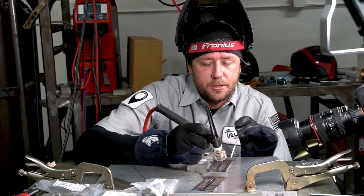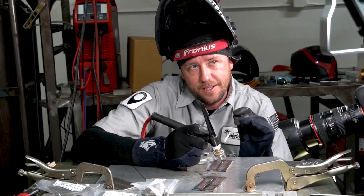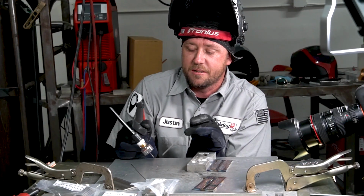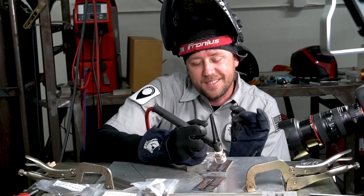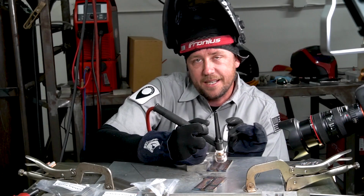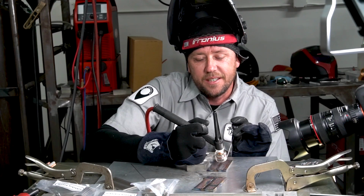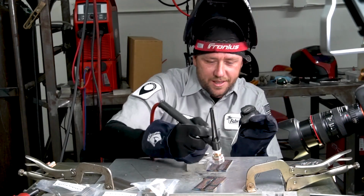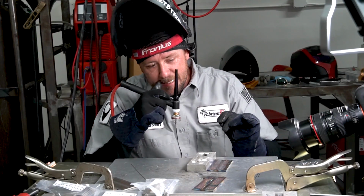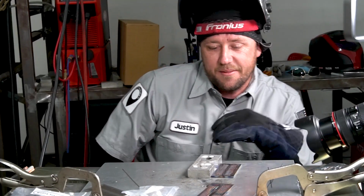Forward meaning the direction that you're traveling, and that's usually kind of tricky because normally you're traveling into your filler wire. On this one, we are technically adding our filler wire to the side of that weld pool because we're traveling back and forth in a zigzag, but technically, even though we're making a zigzag left and right, we're still traveling this way, which this would be forward. So tricky as it may seem, but there's kind of a couple of things.